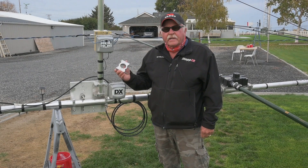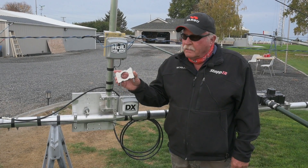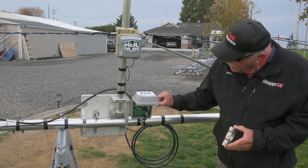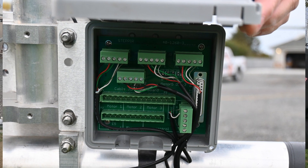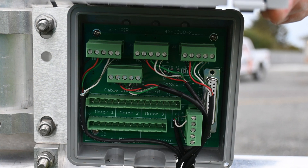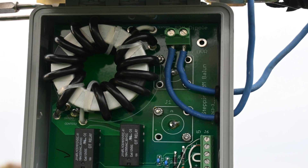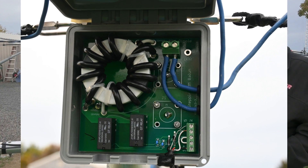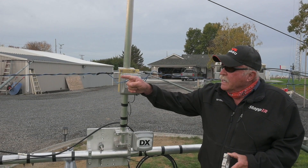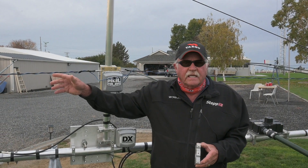The DB36 is a very high-performance four-element antenna utilizing the 50-foot-long main driver. Here's the control box — the connectorizer box. You plug in the connections for the control box, which consists of basically all electronic circuitry. This antenna is also equipped with the 80-meter option, which switches the dipole that runs parallel to the boom and also connects into the director and reflector elements to tune all across the 80-meter band.